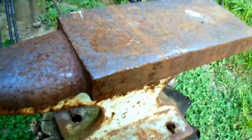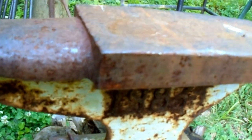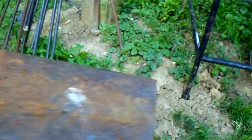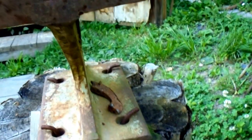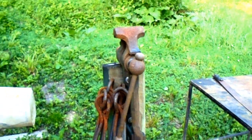This is my anvil. I made this anvil in 1983 in vocational school. There's two pieces of C-channel cut and put back to back with a one-inch piece of steel on top of it. I milled it square and heated and bent the horn and so forth. I've had it since 1983.